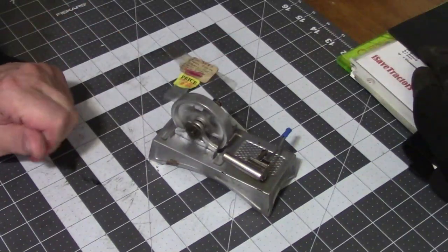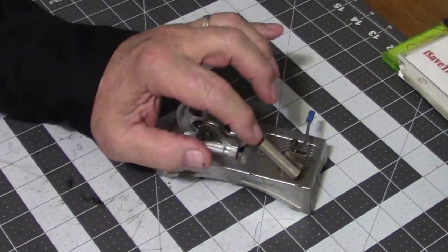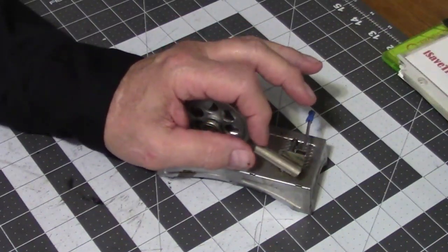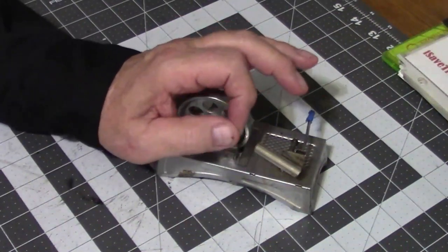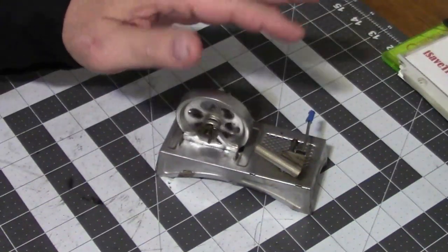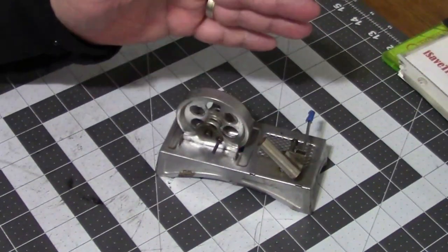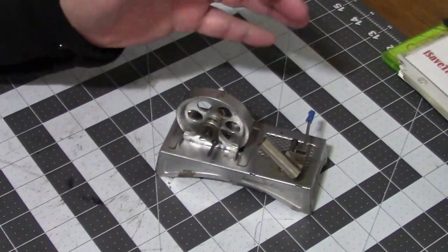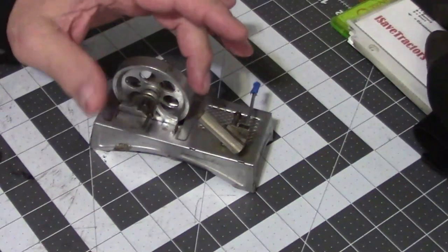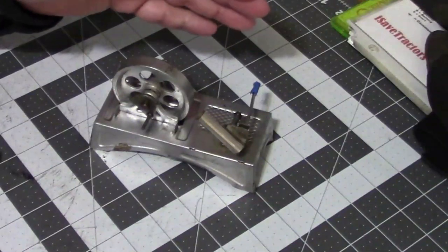For $8 I'd take a chance on it. So I started measuring the inside of this bore here and it was exactly two hundred and fifty thousandths. I started checking stuff, and before I machine something I'm kind of a lazy machinist — I started to look around to see what I might have that was already that size. After looking and measuring, I found something that was the same size: it was an old spade bit.